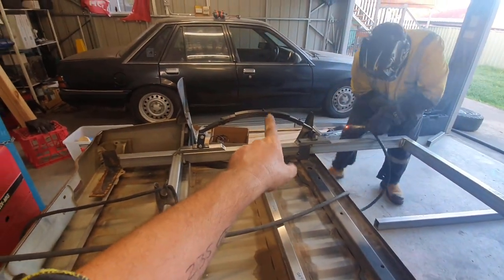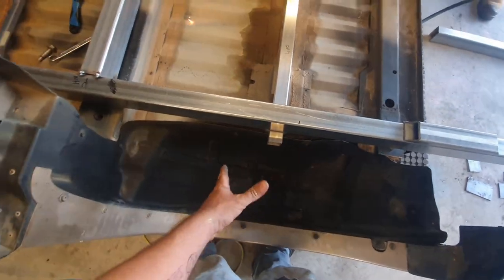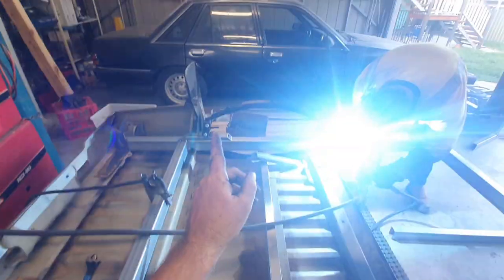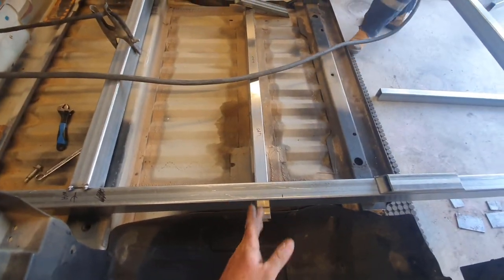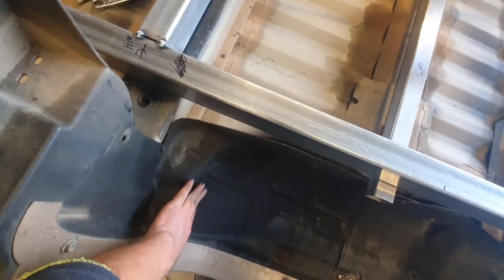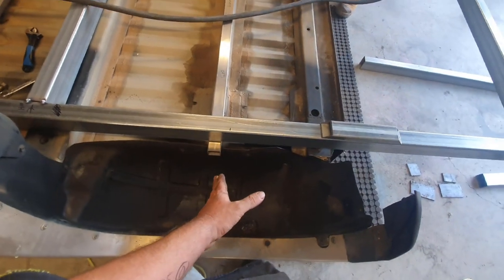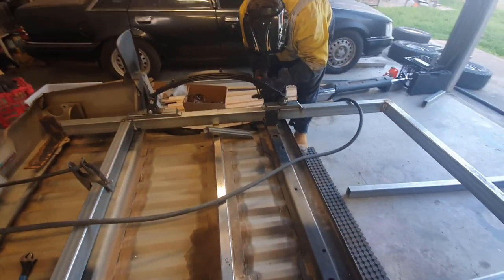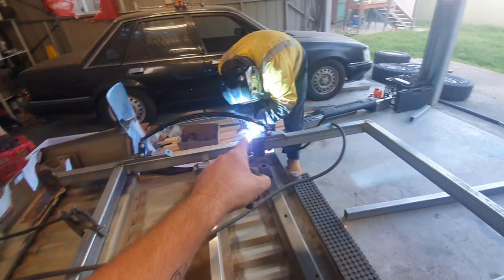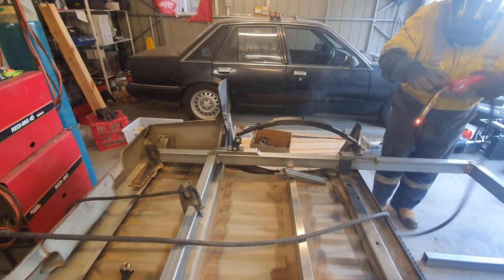And then our axle, we pretty much centered our guard. We're slightly forward, so as it compresses and that bit rolls back, the tire's going to shift back ever so slightly. So we're ever so slightly forward of the guard, just so we don't mince into here, because this comes up to a flat. We're about 10 mil forward of center in the nice dish. So he's just going to tack that, then he'll tack the front, and then we'll look at our angle here to make sure that's okay and go from there.